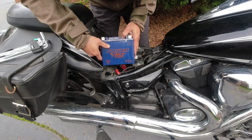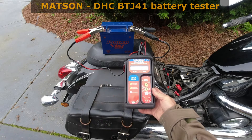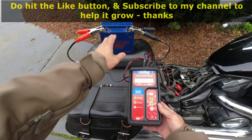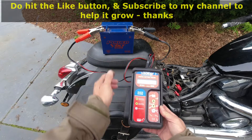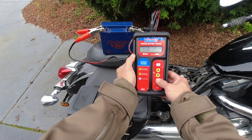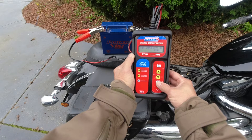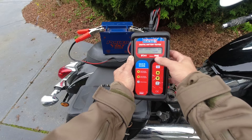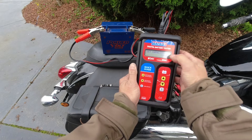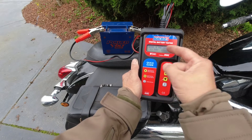This is a Power Volt nano-gel 12 volt 12 Ah battery. I have here my Madsen DHC BTJ41 battery tester. This tester suits valve regulated lead acid batteries like this. Tester connected to the battery — the battery spec says it's 12 volt 12 Ah. I can begin the test. It says the battery is 12.58 volts. Press enter to continue. The type is valve regulated lead acid. I can set the battery capacity; I've set it to 12 Ah, which is the same as printed on the battery. I'll keep it at 12 Ah and press enter. It's testing. It says good and recharge.